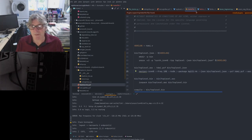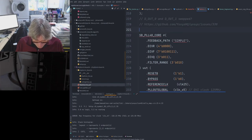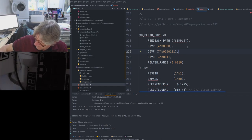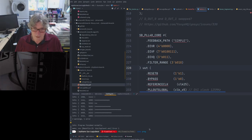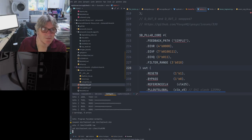Hi, iPost. Yeah, we're playing with HDMI, but we're not having a great deal of luck, quite frankly. There's a couple of issues. One is the reflow didn't work very well on the HDMI connector because the legs poked through, so it's risen up. So the connection is a bit dodgy. But even when we hold it, we're not getting a decent signal out. So if I rebuild this again, now at 100, it'll probably pass.